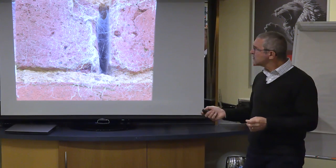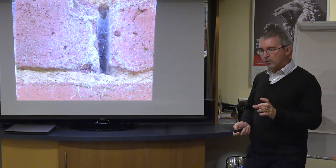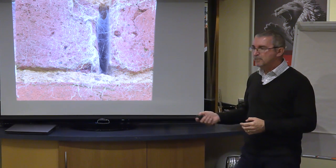You can use this straight away, so you allow the slaking process to go off, and then you can use it. And it's always easy to identify on a stone or a brick wall when it's had a hot lime process, as opposed to the stored lime putty.